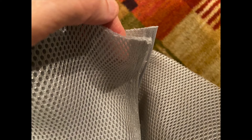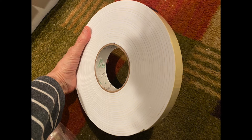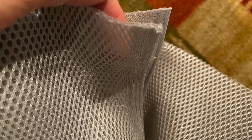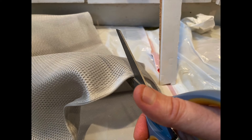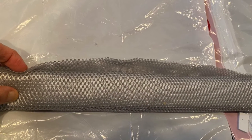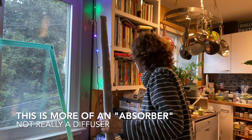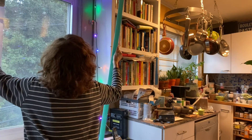I already had some materials at home that I could use — a sheet of cork and a roll of closed cell foam that was an eighth of an inch thick. The idea was to make a sandwich around the wood. Originally I thought the cork would be the backside that goes against the window frame, and the foam would be the absorbent side facing into the cavity, which would then be covered by the honeycomb fabric. So I glued the cork on one side of the wood and applied the foam to the other side. But I didn't have a clear plan on how to attach the fabric to just one side of the wood, so instead I wrapped the fabric around the entire piece of wood two times and made some loose stitches to hold it in place. Then I removed the plexiglass cover over part of my window, inserted the new diffuser strip against the inside of the window frame, put a foam shim at the top to hold it in place, and then put the plexiglass back over the window.